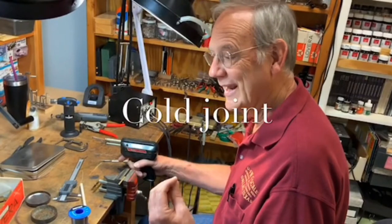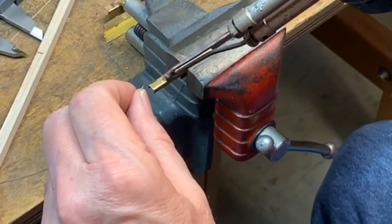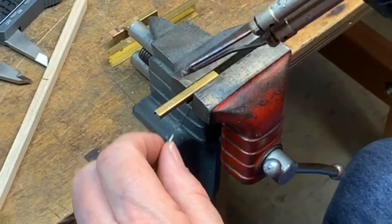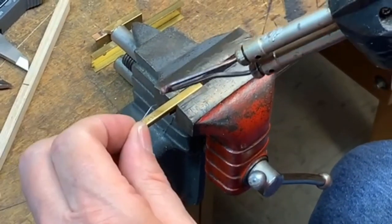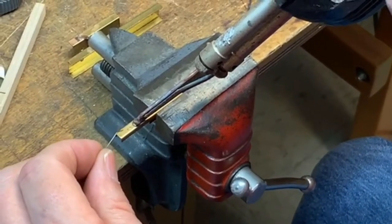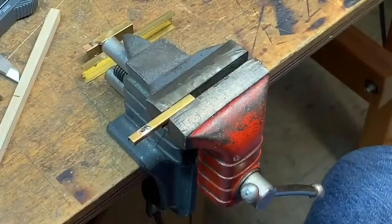A cold joint — remember, a cold joint happens because you didn't heat the work up enough to melt the solder and cause that ionic joint where the solder mixes in with the surface molecules of the work. That occurs when you heat up the solder but not the joint. There's a cold joint — see how that beads up? It doesn't lie flat and smooth, and it pops right off. I melted the solder but it landed on a cold piece of metal, so it didn't make the joint. If you heat the work properly and not the solder, when the work gets up to the proper temperature the solder will flow. And that's a good joint — see how it flows and by capillary action fills up all the area that has been heated.